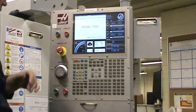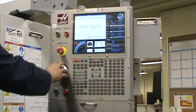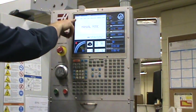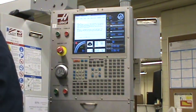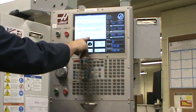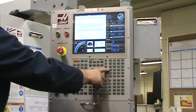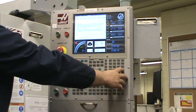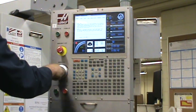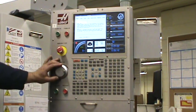You've got hand jog — this is how you can use these buttons with the handle jog. On this machine, if you notice, I turned the button and the machine doesn't move, but this is flashing up here. When you hit hand jog, it brings this screen up. You want to make sure manual is highlighted in red, and it's going to show manual mode here. Hit the right enter button. Now it tells you in two places what axis is active. You're jogging in your Z-axis, and it's telling you how fast. Over here it's also flashing red in Z. Your speed options for jogs are .0001 — which is the slowest — up to .1, which is your fastest. To change the axis, you hit the corresponding button, same thing with Y. That's how you can manually move around in the machine when you're doing your edge pickups and whatever else you need to do.